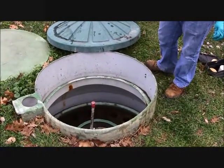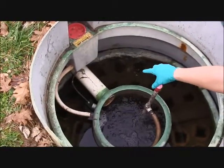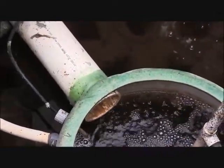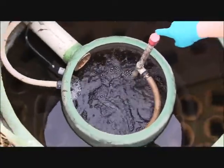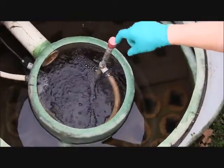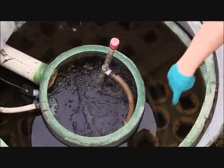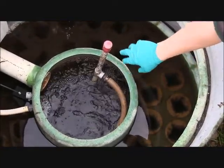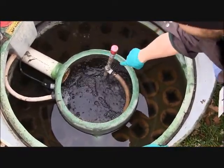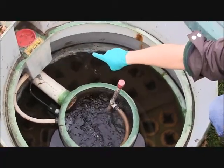Now that we've removed the surge bowl, we can see the inner workings of the multi-flow treatment unit. Waste enters the system by means of the main sewer, which is the 4-inch PVC pipe. All waste produced in the house is funneled directly into the central area known as the tower. Upon inspecting the tower, we look at the upper rim, or flange, first to ensure it is intact so that the surge bowl may create a proper seal and prevent bypass of untreated waste onto the weir deck. We also ensure that the connections to the motor are properly routed, including the ventilation pipe, which routes through the tower up to the junction where air is sucked in and the motor is fed.